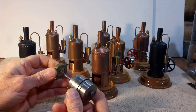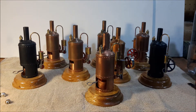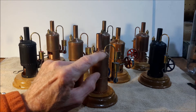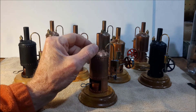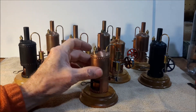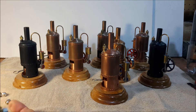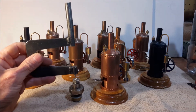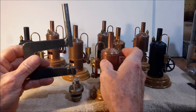And then this particular one is for the bottom. Once they're made to fit in the copper jacket, they're drilled out for the little packing nut right here for the steam line, a little ferrule here for the fill pipe and safety valve. And then this, I think, is three-eighths inch copper for the fire stack — that's the flue. The dimpling on the copper tubing is made with a little tool that I put in my drill press. The copper is slid over and by pushing down with the drill press you can dimple these lines all the way around to give it the effect of a rivet line.